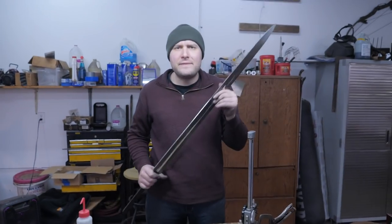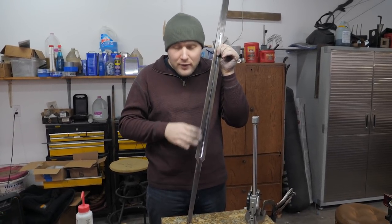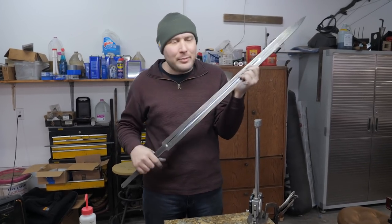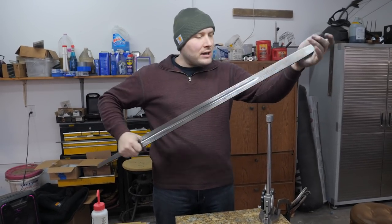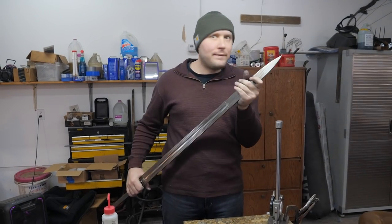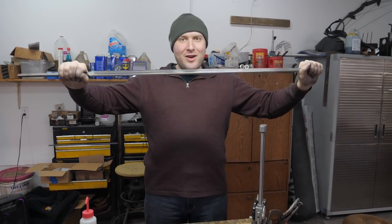I've got a mark in the center and a 50 thousandths wide mark as well to use as reference points. There are a couple of slight wobbles in the blade so those marks transferred a bit onto the edge, but hopefully I can get that taken care of with grinding and use the marks as a reference while slightly adjusting as I go. This blade is now ready for the blade bevels to be ground in, and we'll finally start seriously removing material and weight — right now it's almost five pounds, pretty heavy. The fuller removed a little weight but not a whole lot, and there's a lot of grinding to do. The longest blade I've ever done was an 18-inch blade; this thing is about 36 inches right now, so it's quite a bit longer. Hopefully it'll go well.